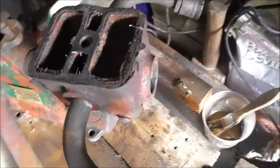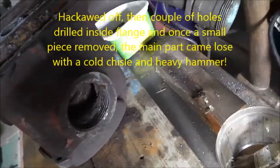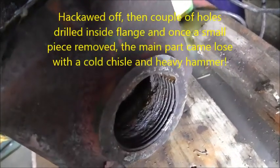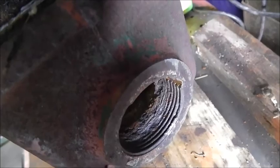I've had to cut the plug off the end, but I've got a new brass one for it. I've got to reduce it because the thread inside is a bit knurled up, so I've got to reduce it to clear the inside.